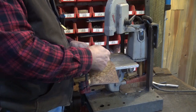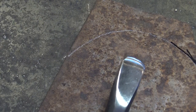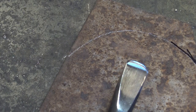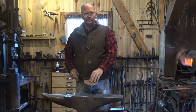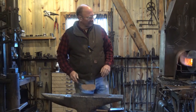Unfortunately this saw won't turn that tight of a corner, so you've got to kind of work your way into it — not really a big deal. Just a reminder on the cold chisel: the edge is a little bit rounded, the corners particularly are rounded, and that helps you follow a curved line. A narrower width chisel will follow a tighter line, and a wider width chisel follows a bigger radius. You could work some of this cold if you anneal the material first, but it's going to stress harden and you risk cracking it. I prefer to just work it hot for the most part — I do a little bit of final cleanup cold, but that's about it.